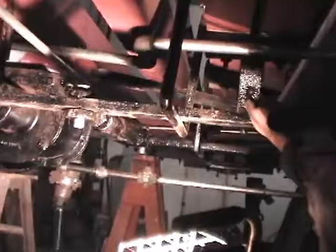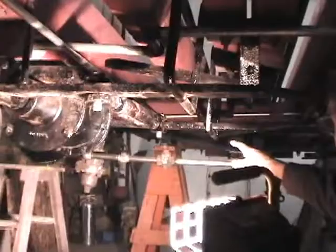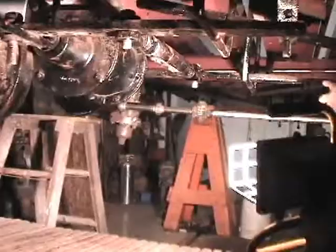These are the various brake levers. This one is the live lever — the brake cylinder piston pushes this out and then pulls from here. There will be a rod that goes back to a truck, and that's what actually pulls on this end. Because of the way it's put together with a turnbuckle in between, it will also pull in the other direction with the other lever. Up above is the handbrake lever, which works in emergencies and will also operate these levers.